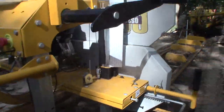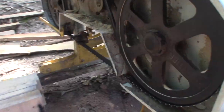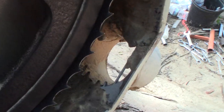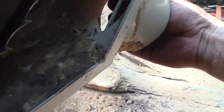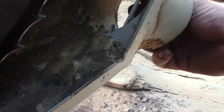Oh yes, hang on one moment, we're going to go around over here for a complaint that I have about this machine. We're going to look down in here really quick, and I understand this is a safety issue, and I'm fairly certain I voided a warranty somewhere, but whatever, I don't care. So when you get the sawdust exhaust port from the factory, you'll look down in here. From the factory, it has these little wires built in all along here, and I've cut mine out.